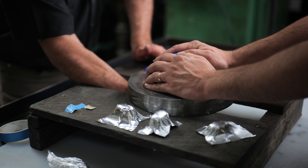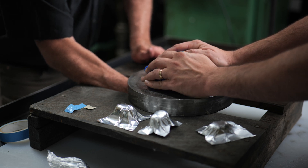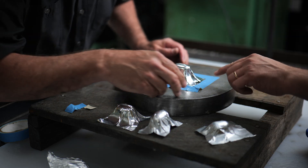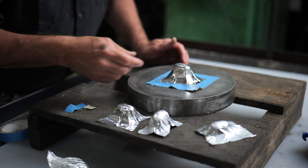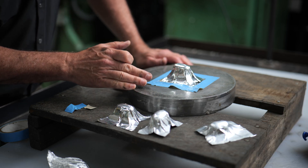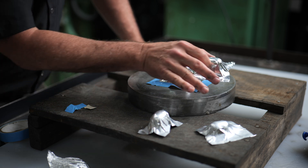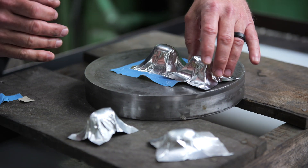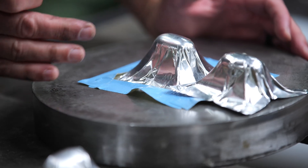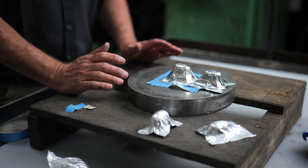Hydroform activated. It didn't rip. And now, especially on this side, you're almost seeing no wrinkling on the part. If you're looking at the difference between the two — where you're getting more wrinkling in here before, now we restricted it using the tape and you're getting it to stretch a little bit. We're actually getting really close to simulating hydroforming.